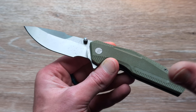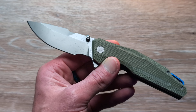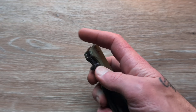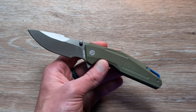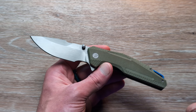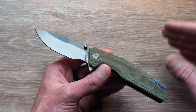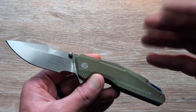They use a lot of 14C28N steel, and they hit it at, in my opinion, the best spot — between 60 and 62 HRC. That is right where they are hitting the 14C. Not to misconstrue that every steel needs to be between 60 and 62 — that's not the case with all steels. There are quite a few that really shine in that range, but not all of them. For 14C, anywhere between 58 and 62 is going to be good, and 60 to 62 is going to be very good in my opinion and in my experience.